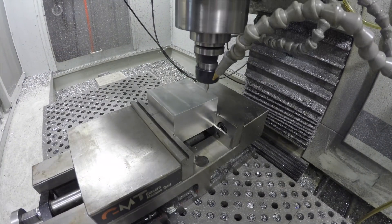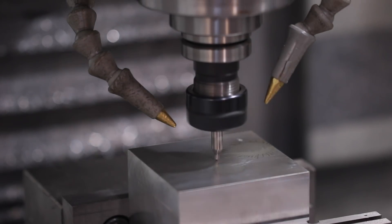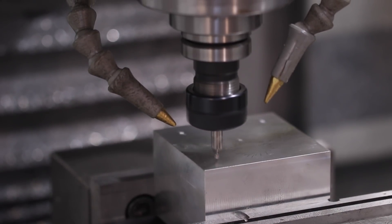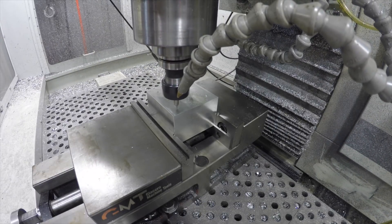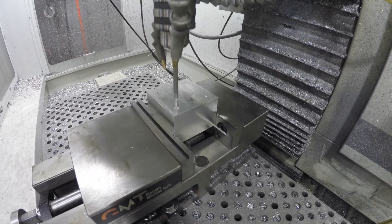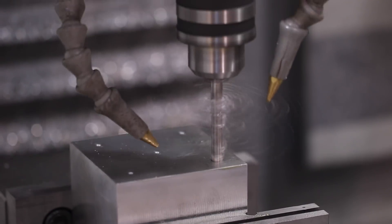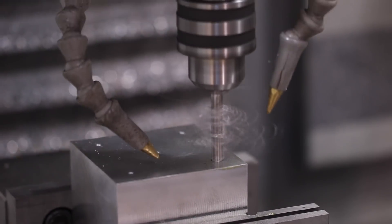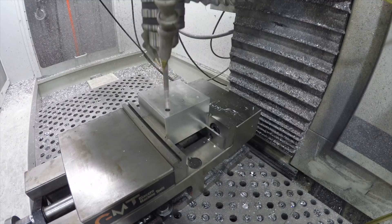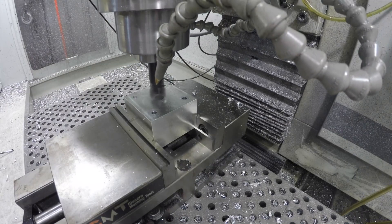Spotting at 1500 RPM, only two inches a minute — pretty slow. I only went down negative 0.1. Should have gone deeper. You actually want to get into the actual angle of that center cutting tool. Now the letter F drill — I like this recipe. It does bird's nest a hair. 2750 RPM, 8.2 inches a minute. I may actually need to feed a little faster, and we're pecking about every 0.050.